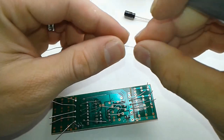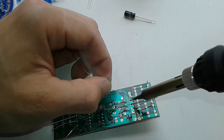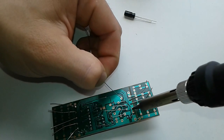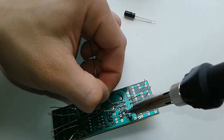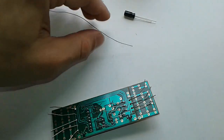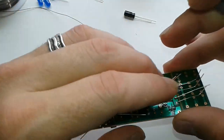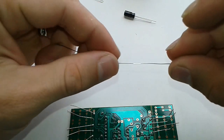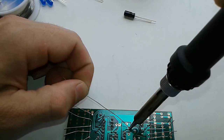These resistors and diodes are very easy to fix. The resistor doesn't matter which way you put it in, but a diode has a black dot that shows the direction you have to put it. So it's pretty straightforward — you cannot go wrong. By the way, you can save the cut pins from the resistors and reuse them — nothing is thrown away, everything is reused.